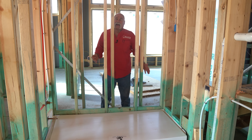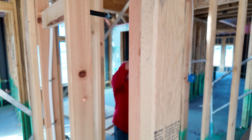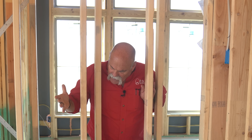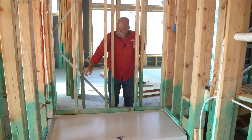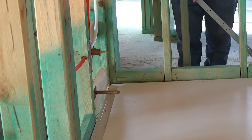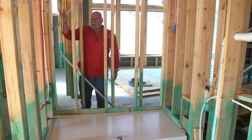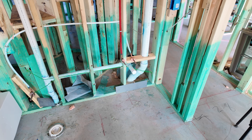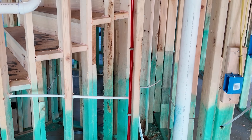So right here, you've got your tub and shower. One thing I love about it is how tall the shower head is roughed in — I hate when I see plumbers put them in at like six foot thinking that's going to be tall enough, but then by the time you put in a shower head and it turns down, literally your shower head's right down here in your face. I love this — it's a steel tub already installed. The water line for the tub spout is copper, it's anchored down tight. You've got PEX coming in. You've got the valve screwed into the wall and it's a mixing valve. It's screwed into the wall where everything's secure — nothing moves. You've got PEX going up to the drop-eared L, and it stubs out high enough. There's not many people that are going to have a problem taking a shower in here. Then your bathroom — you see the toilet flange already down. You've got your lavatory roughed in over there. They've got copper stub outs for everything, which to me makes it where the homeowner should never have a problem.